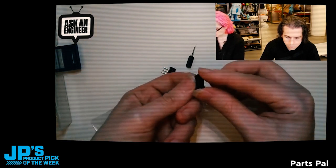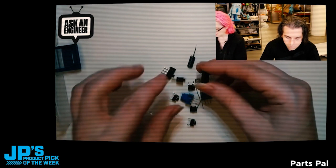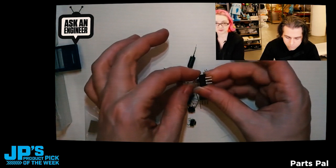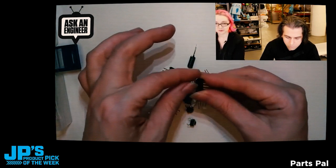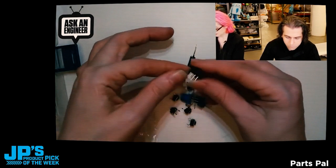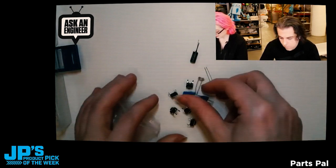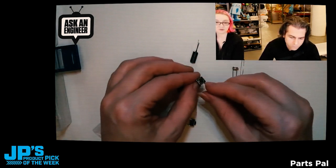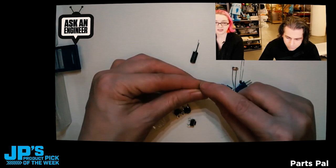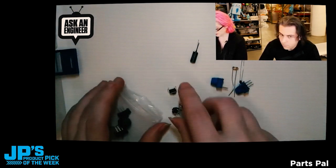You get 3 breadboard friendly slide switches. They fit into a breadboard, and they have single pole, double throw. Yeah, that's right. I always get those confused. Slide switch, so it's kind of handy. You get 3 of those. You get 5 6mm tactile switches. These are also breadboard friendly, and you press, and then the pins short, handy for basic interfaces.